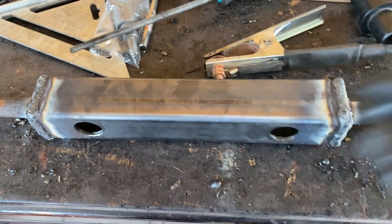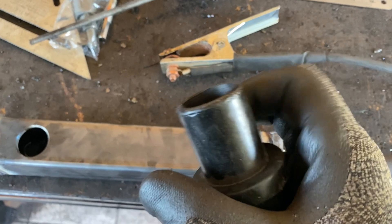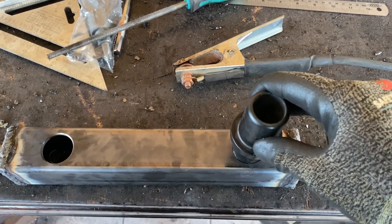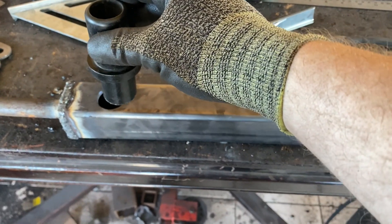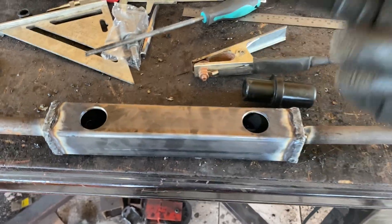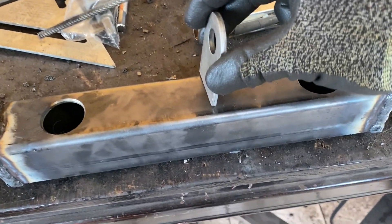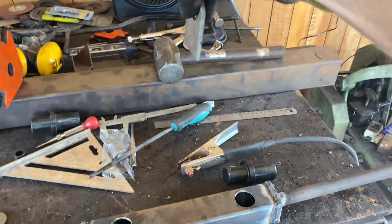Through these 32 millimeter holes I have these plastic sleeves — this one is 32 millimeter here, 35 millimeter up here. This will plug in straight to the top and as you can see it's a tight fit. I have to take a rubber mallet and hammer it into place, which keeps it from lifting back out. There will be one on either side, which will allow a nice smooth, slippery interior to go up and down those chrome rails. And then I'll take one of these tabs and put it in the middle so I can loop the cable through to actually lift it up and down the slide.